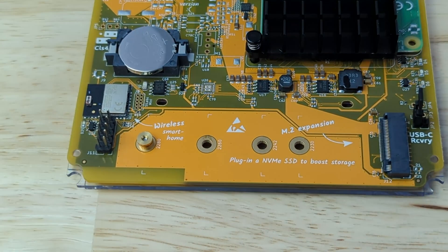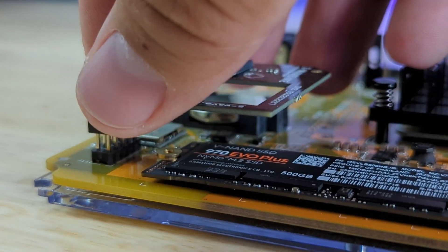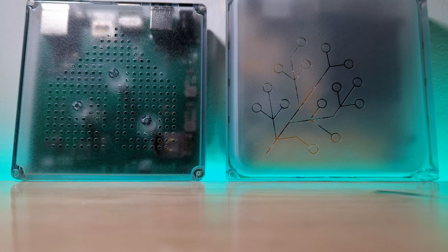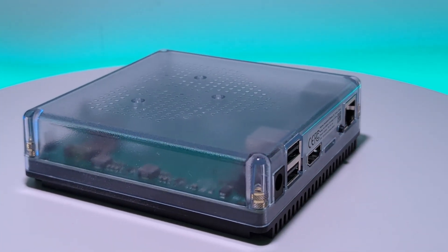Where the Yellow really stands out is upgradability. It has an M.2 expansion slot for additional storage, a built-in Zigbee radio, and the potential to add a CM4 with Bluetooth so you can connect Bluetooth devices without a dongle. You can also add Z-Wave using the exposed GPIO pins with a Z-Wave hat. There's also a PoE version of the Yellow, so you only need one cable. If you're new to Home Assistant and not a tinkerer, it's a no-brainer to go with the Green at $99 — you can always add Zigbee and Z-Wave dongles later. But if you want to dive in and get the most out of one device, go with the Yellow for its built-in Zigbee, easy Z-Wave, and Bluetooth options.